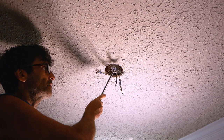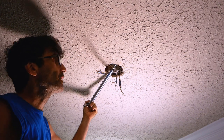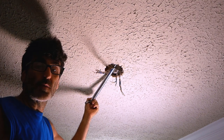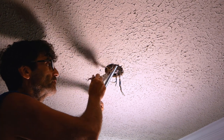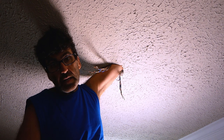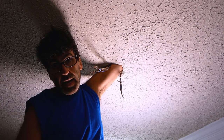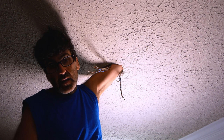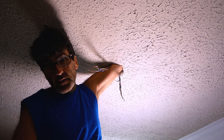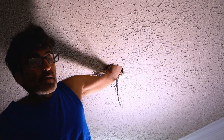I went ahead and expanded it some. Most of the time ceiling joists are 24 on center, which means you have about 22 and a half inches between the joists. If you're in a ceiling with a floor above those will be different so you might not be able to expand it ahead of time. Make sure when you expand it that it's seated against wood and not a wire or a piece of pipe — there actually was a wire on the other joist here and that would have been a whole lot of sadness.